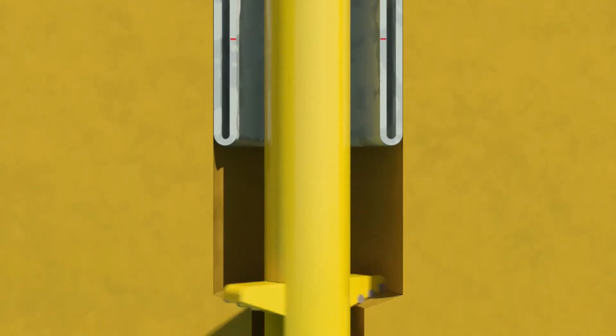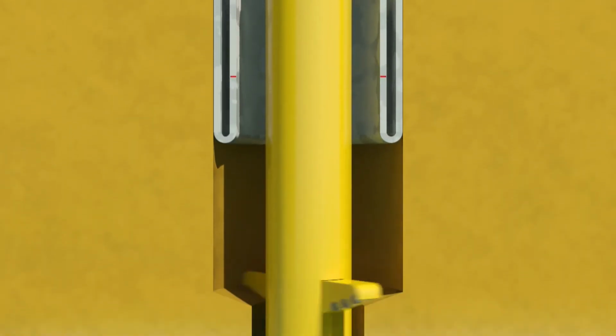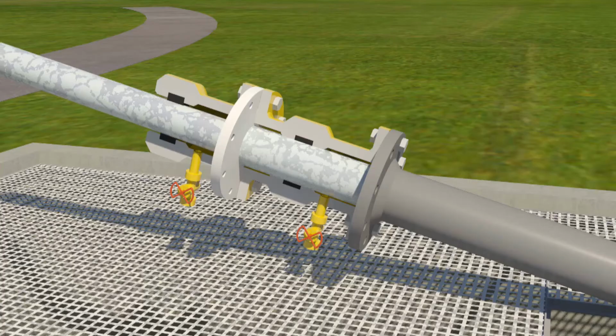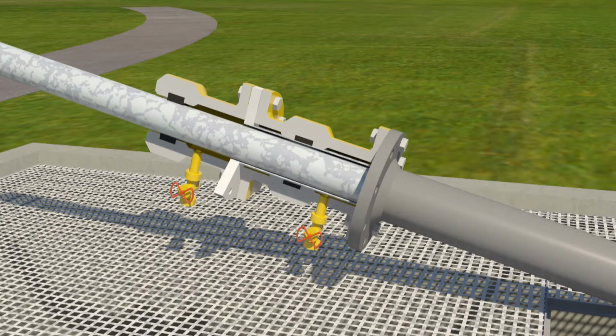The double-walled casing is created by pushing the inner pipe downwards from the surface and then folding it inside out at the bending zone. The outer pipe, which is extended at the bending zone, is effectively stationary with respect to the formation. The outer pipe is hung off at the surface in a simple wellhead.